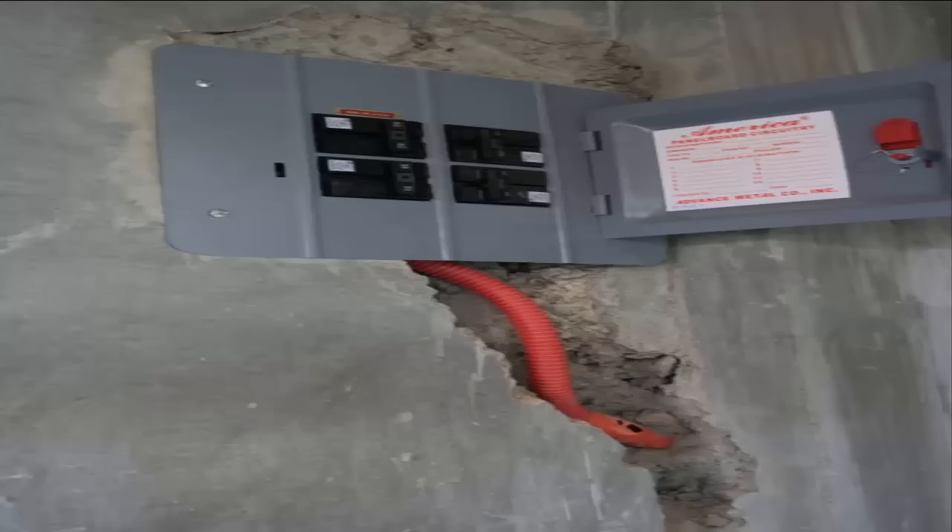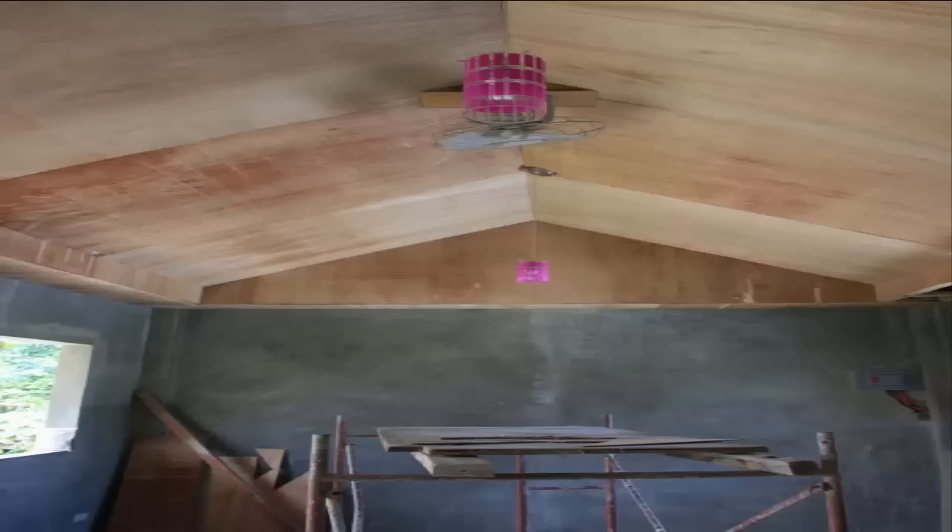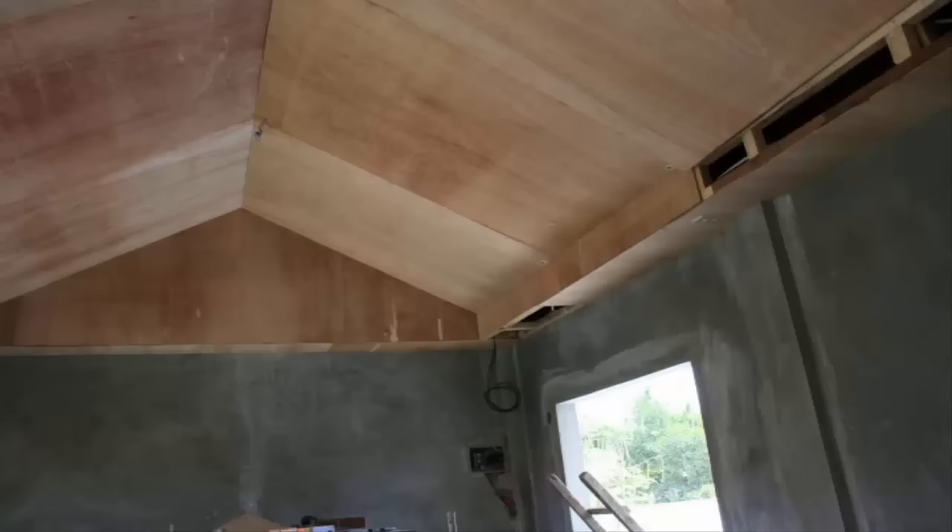As you can see, the electrical circuit is going in and there are separate circuits: one for light, one for aircon, one for kitchen electrics, and one for sockets. This is the plywood ceiling going in. In future builds we use gypsum, which is much faster for plastering, sealing and painting than messing around with plywood.